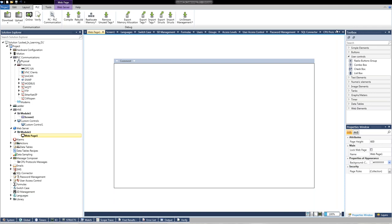Which devices could use the virtual HMI? So the virtual HMI, that is our interface to our PLC that you have created, and it is hosted as a VNC server. So we are serving that image of that interface that we've created. So any application that supports VNC clients, any VNC client would be able to connect to the controller and use it.